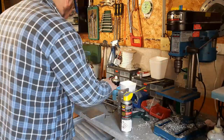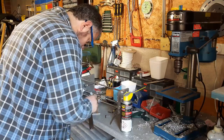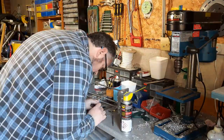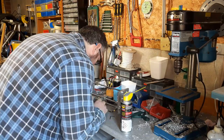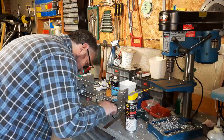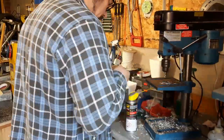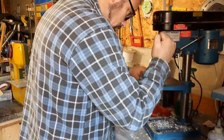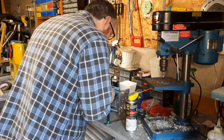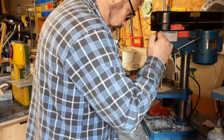You can just see me then on the bandsaw — I've been marking out this plate. This is going to go on top of the linear bearing blocks, and that's going to eventually carry the 3D printer head, but it also needs to carry some other fixings for fixing the belts to the platform. The camera angle's not great this time around, so sorry about that, but basically just going through and drilling all these holes to make sure I can attach all the bearings as I go along.